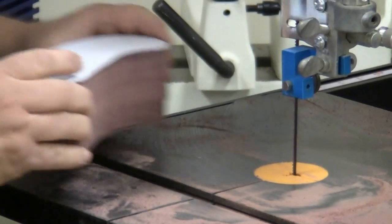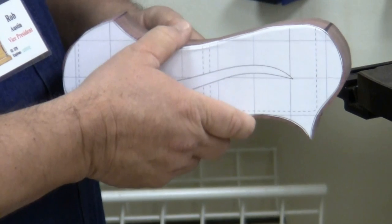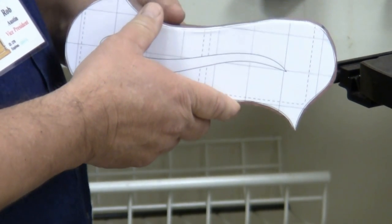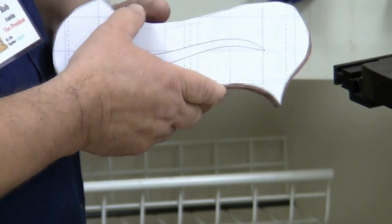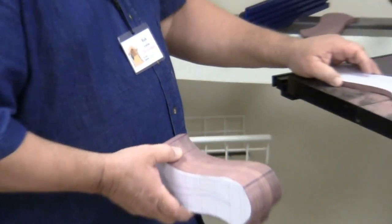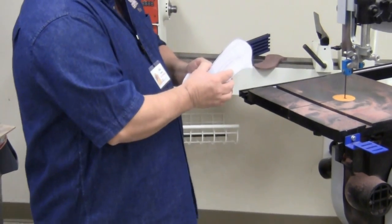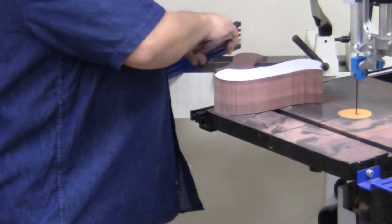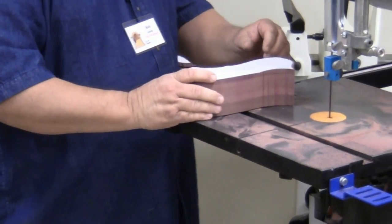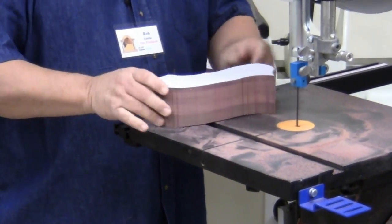Hey, Rob, what was the reason for cutting off the back of the front? So I cut out the middle without getting it gone. Well, I'm saying the reason is because you have a set blade and the blade is there. No, that's if you don't cut the front off of this. If you had a scroll saw, you could drill. We've got to do the same thing on a scroll saw. That's the reason behind it. It allows you to cut that cavity out without messing up the front of it, as opposed to breaking the blade and rewelding it. You can always use some sort of Forstner bits and clear it out, but that's a lot of work. Okay.